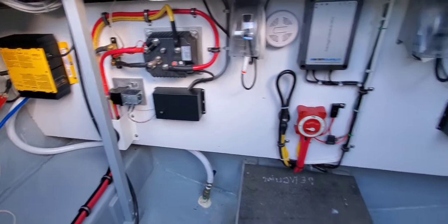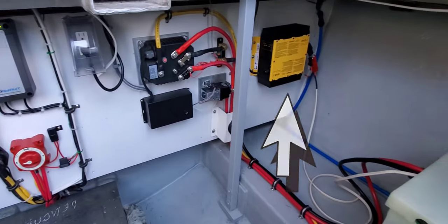For the recreational boating scene in North America, many marinas offer what is called shore power or dockside power — the provisioning of AC power to your vessel at berth. This eliminates the need to run your engine, generator, or drain down your batteries if you're running electrical equipment that requires AC power. For eTolli, we have two chargers charging up the battery banks for each motor; those chargers require AC input, which gets converted to DC to charge the batteries.